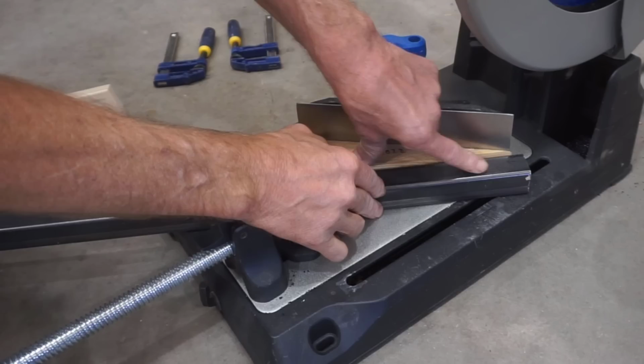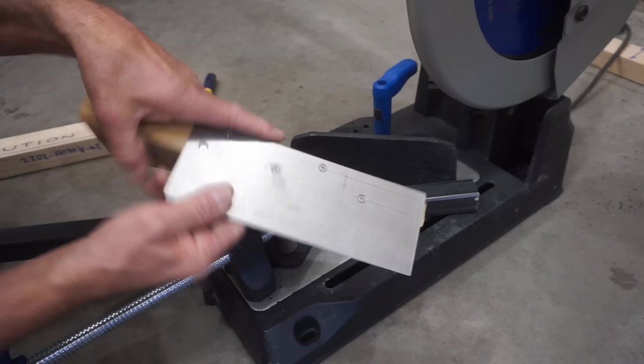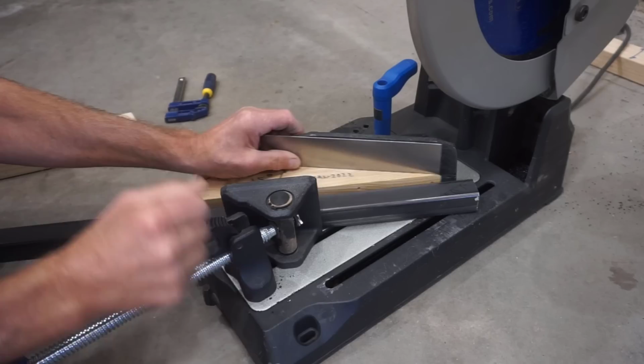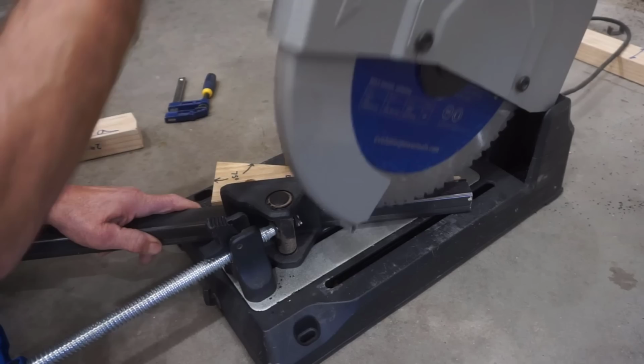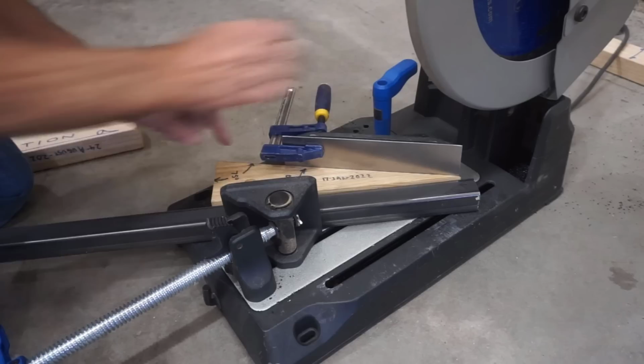And to accomplish that, I added this piece of steel plate to the angle block with 5 screws so that plate is firmly attached to the block of wood. Then I can slide it into place and get everything positioned for this cut. And then I use a positive clamp on the miter fence to make sure that wooden angle spacer block isn't going anywhere. I double check the position of the cut.